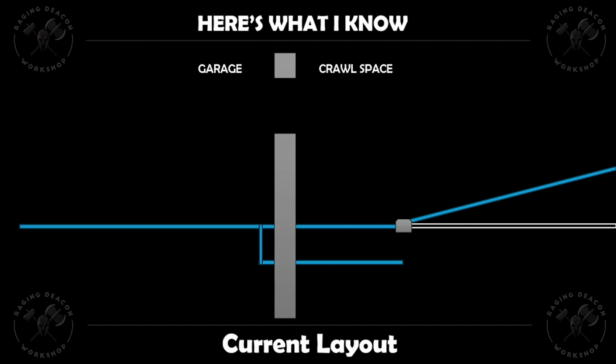You're probably wondering, or asking, Jeff, why does it do that? I think the previous owners had a water softener tank, and that's where the tank was, and it looked like it had hookups for that right there. It then connects with the water supply line for the rest of the house. Why is that a different color? It's because, once again, the type of pipe changes. The blue pipe is PVC pipe. When it gets to that sort of greenish pipe, it becomes CPVC pipe. I just wanted to mark that on there.